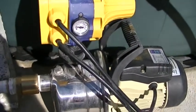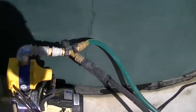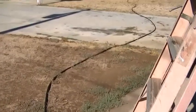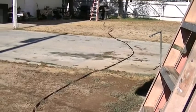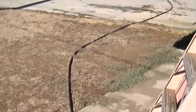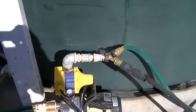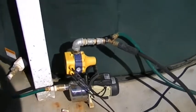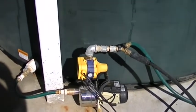When you install this pump, it's critical that you take that plug out, open up your valve, and let the water push all the air out. Put the plug back in, and then you'll have no problem with priming — otherwise it may not prime correctly. The hose is hooked up here and runs to the house across the driveway. I'll point you to a video for the hose I found that works well in a situation where cars run over it. We've had this in use for several months now with no complaints and we're getting potable water every week.